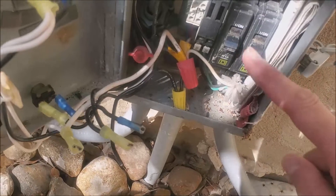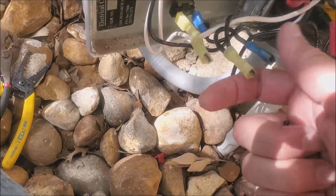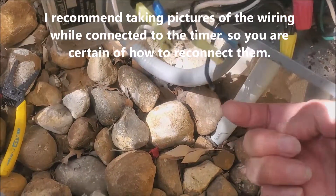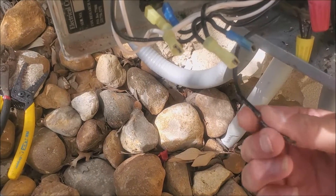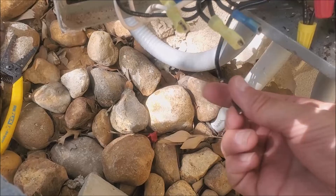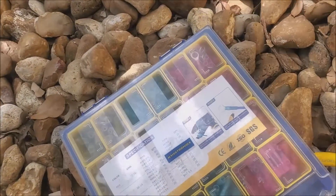First thing you do is switch off the breakers, obviously. I removed the old timer from here and cut a couple of zip ties that were holding everything together. I needed this wire — this is the bad one. I cut it clean about an inch down because this end is pretty charred right here. I got a nice, good section of new wire and I'm going to put one of these spade lugs on it.